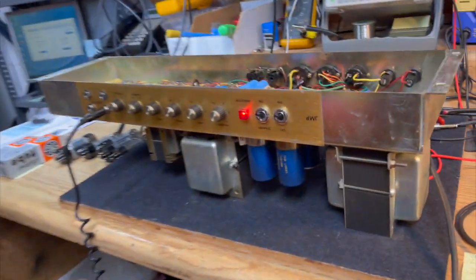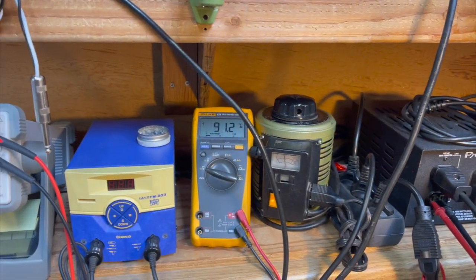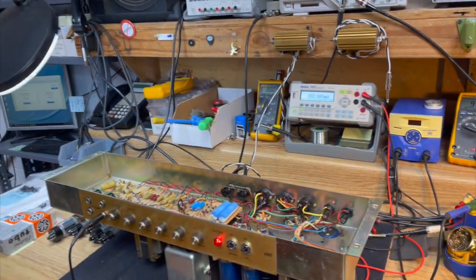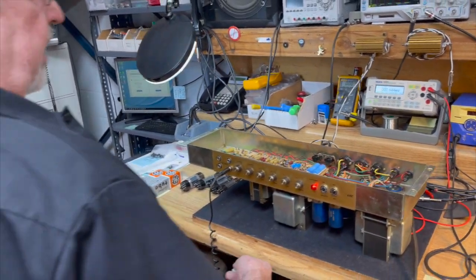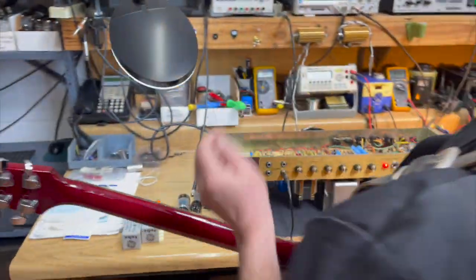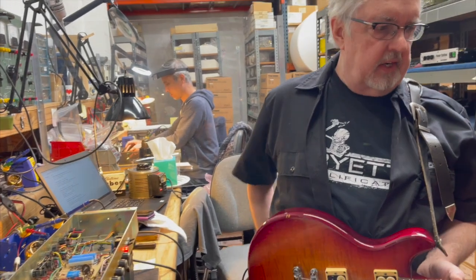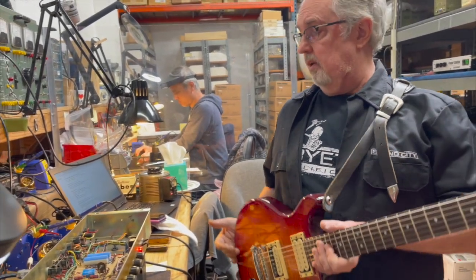Right hand sweep, 90 volts AC in, biased max so that the power tubes aren't crossing over too badly at this lower plate voltage, and we're not doing any serious life-threatening stuff to the cabinet because it's only seeing 18 watts.